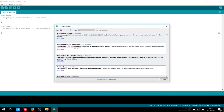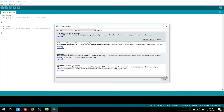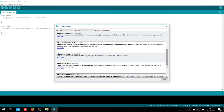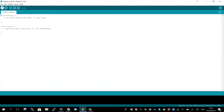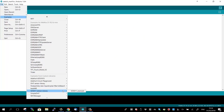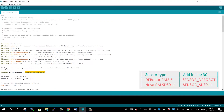Go to include library and install the following four additional libraries: Wi-Fi Manager, DHT sensor library, Adafruit's unified sensor library, and the ESP8266 Wi-Fi library. Now open the zip file library that you just downloaded and open the WeMOS Advanced Sketch. For that, go to file, examples, Hackair. Add your authorization token and check your sensor type.